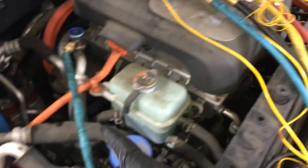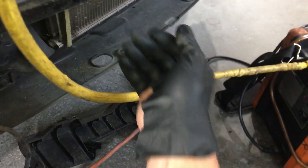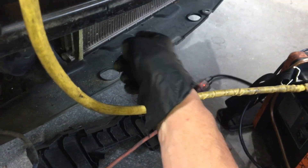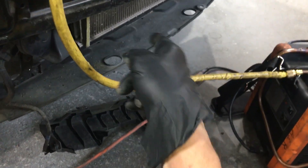It's taken a long time to pull the refrigerant out of this one. These lines right here, even the headers — the refrigerant down in the lower header of this heat exchanger is just before ice crystals, and condensation is starting to build up because of the refrigerant being pulled out, lowering the pressure. There's a ton of refrigerant down there and this whole system is just icing up.